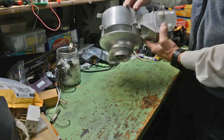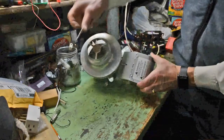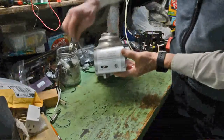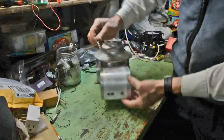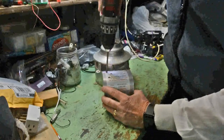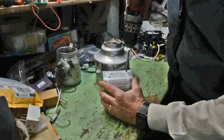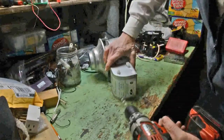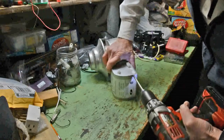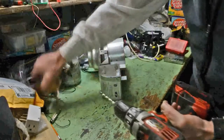Parts we're going to have a look at are in the box where my left hand is. We'll need to get in there, and to do so we're going to drill the flanges off the pop rivets, 4 of them, using about a 1/4 inch diameter drill. Not really fussy, just as long as you can get the flanges to let go. Again, we want to take care that we don't knock the damper out of round so that the flap valve doesn't want to turn.